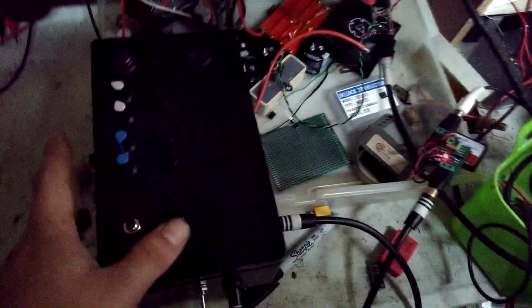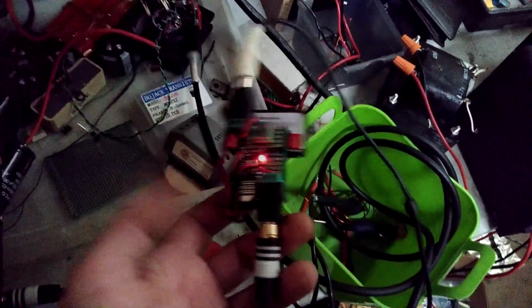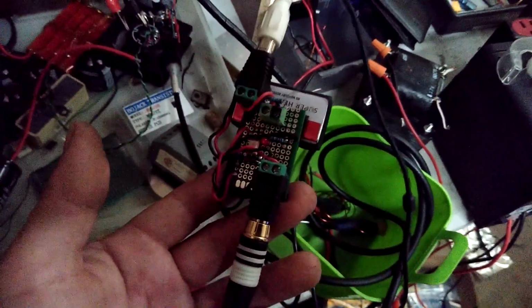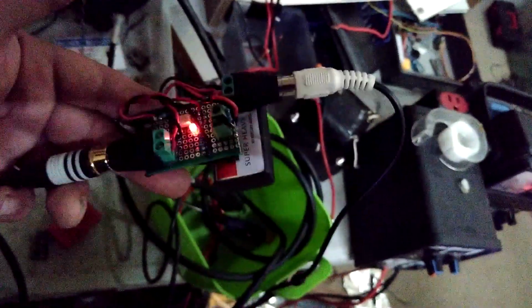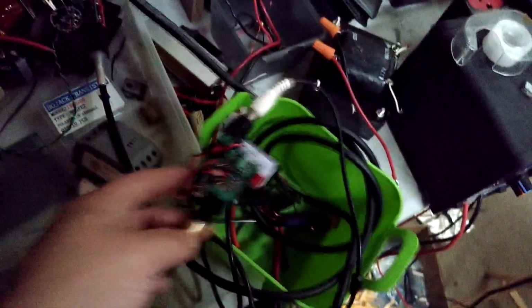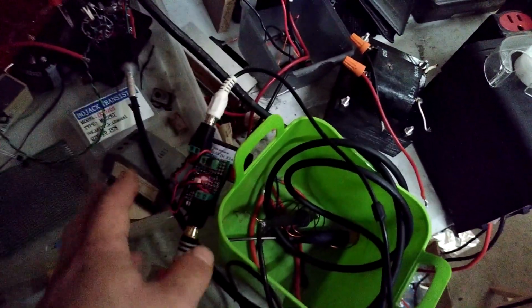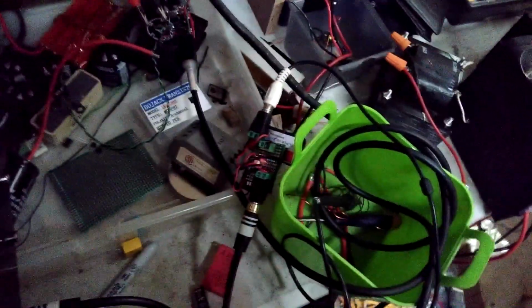I'm just going to use my main interrupter that I put the Staccato controller in. I'm just going to have one little isolation module like this. So that's just an optocoupler and a 9-volt battery. And I've just got a couple connectors. So just put this in between a couple cables basically. And I found that to be a little more reliable than trying to shield that in an enclosure and ground it and all that stuff. It seems like you can just isolate it that way, a little further away, and it runs fine. So with this deal, I'll go ahead and cut it on.